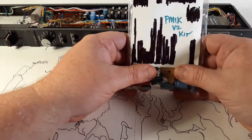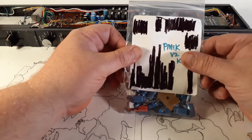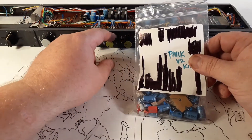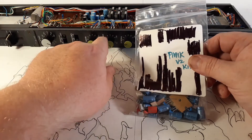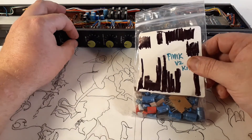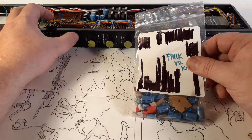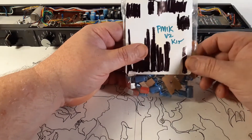This one's a total redesign. I know a bit more about designing circuits now — I know a bit more about feedback networks and such. I also did a bit more fine-tuned math and tweaked the EQ values so that the mid range was closer to what I'd call standard studio frequencies. 1k, 2k, and 4k is kind of an odd place, and the result of that is my version 2 kit, which is what this is.